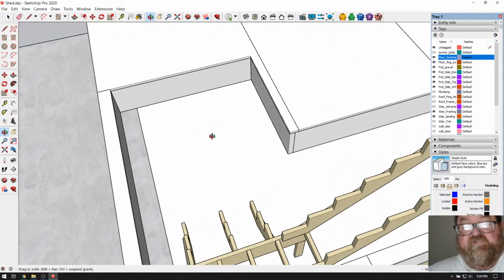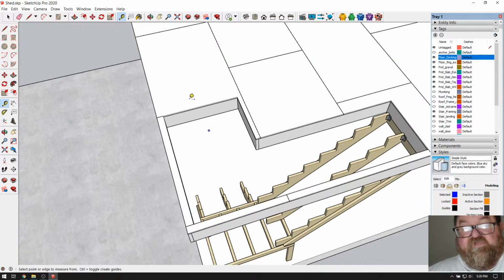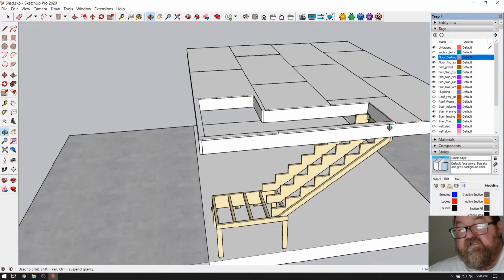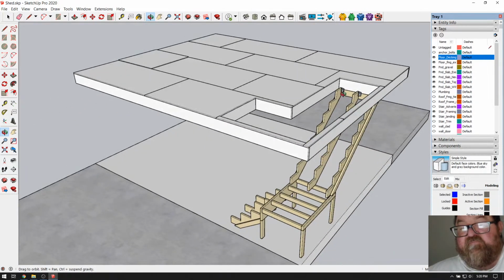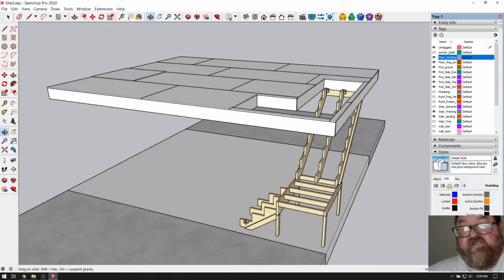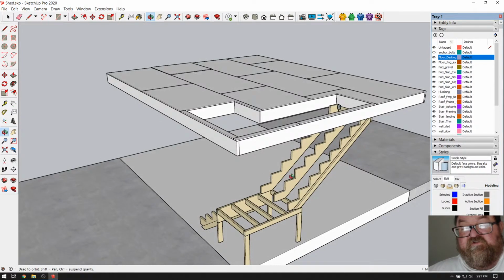But what you want to do is take your dimension after you've framed your second floor, or whatever it is your framing is done, and measure it, okay? Right, so that's 96.5. You want to measure it where it lands, not where the stair starts out. You want to measure it back here. The stair does not land out here. The stair lands over here. There could be a significant difference in the concrete, an old concrete slab, between here and here, and you might get a surprise after you've gone through all this trouble to cut your stringers.